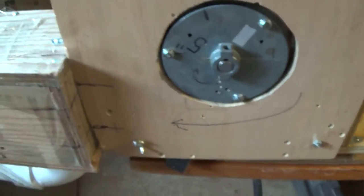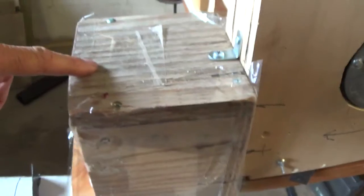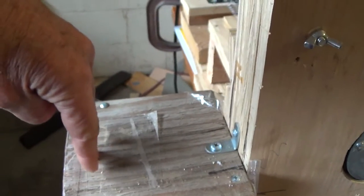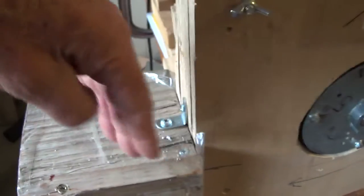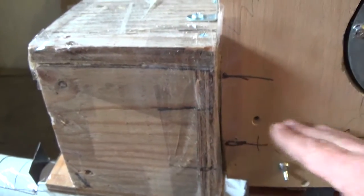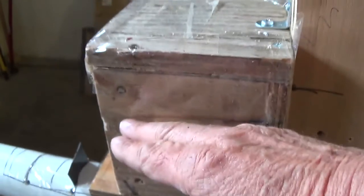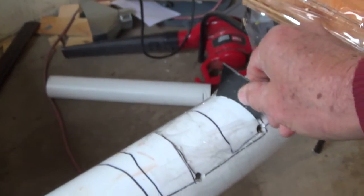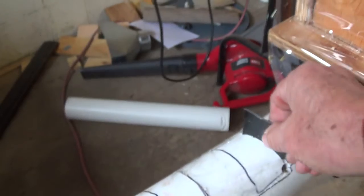Other videos show that. What we've changed is, coming out now, we have this box. Right straight down here there's a neoprene 60 durometer piece that's acting as an impact surface. So the grain is coming out the bottom down here, shooting into here, hits this neoprene, drops down into this PVC pipe. We had to figure out a way to keep the hull grains from going up and into our system. So this right here is actually some of this neoprene that I put in here and acts as a baffle.